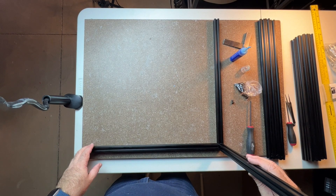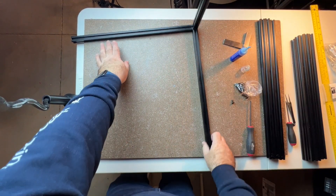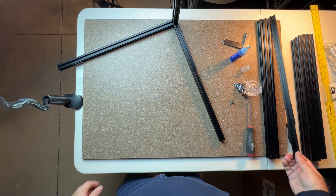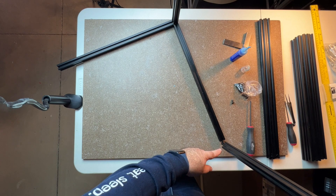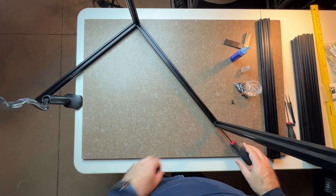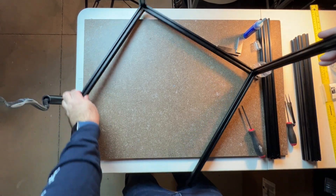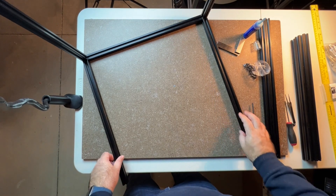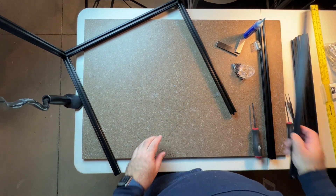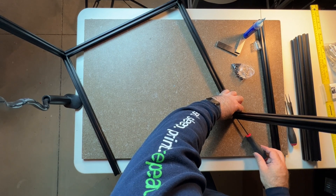Now that I've got the first corner done, I'm going to go ahead and repeat for the next corner, this corner, and then this corner. I'll rotate my extrusion — I've already got a screw threaded here. I'm going to take one of the longer extrusions again with the holes and fasten that blind joint the same way. We're going to rotate and finish these remaining corners using the same procedure — grab the corner piece and put it in, not completely snugged yet, just tight enough so it doesn't wobble too bad.